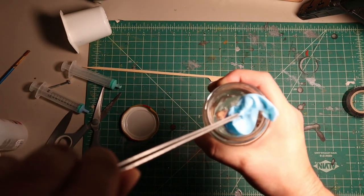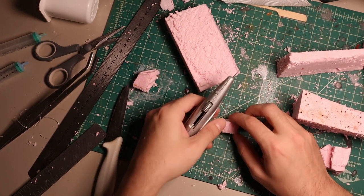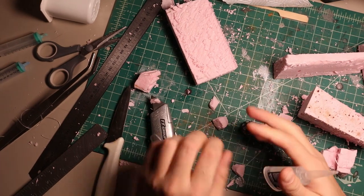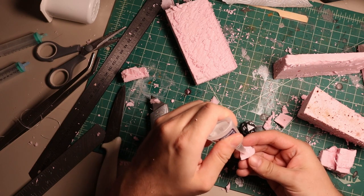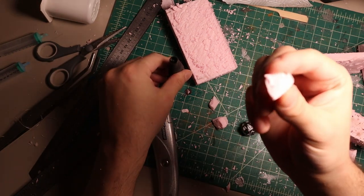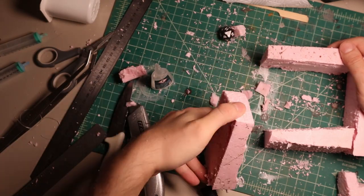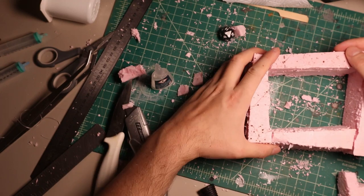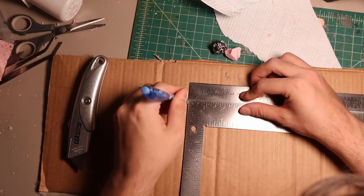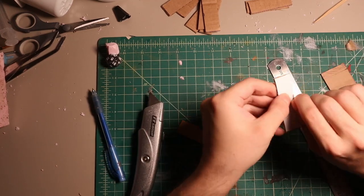The first thing I wanted to do was create the vaguely pyramid-shaped wedge for the D20. I used XPS foam — no need to be really precise, the point is to have a large surface area for the acetone to evaporate from. I tested some superglue on a piece of foam and it seemed to not react, so I used it to glue the pyramid on. It turns out it does react, it just needs some time — so I glued the damaged wedge back, this time with PVA. Next it was time to make the box to pour the silicone in. I tried hacking away XPS foam again but without a hot wire cutter I couldn't make it straight enough. So I cut out some cardboard pieces using a carpenter square and a sliding metal ruler. Turns out my cutting mat was warped, so it was a bit hard, but in the end I had some walls.